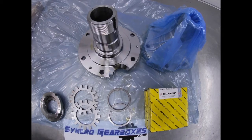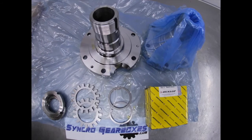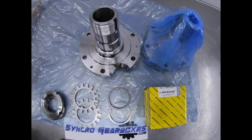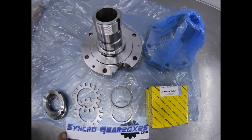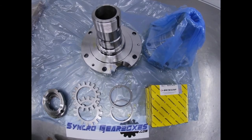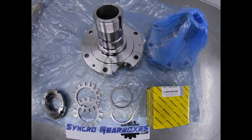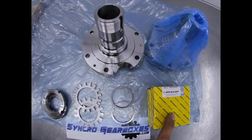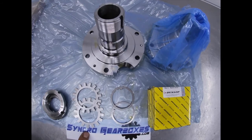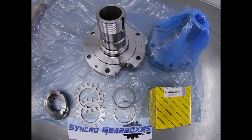There are some fitting differences I'll talk about, but first I'll explain what you get in the kit. You've got two stub axles, the lock nut, lock tabs, washers, and bearings — one per stub. In assembly orientation, the outer wheel bearing goes on first, then the washer behind it, then the lock tab, and then you preload those to Nissan specs.